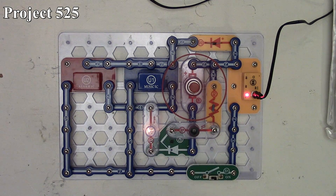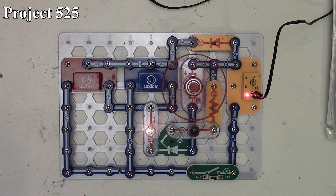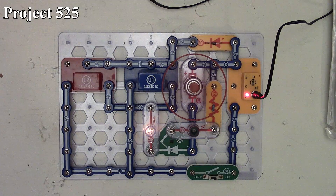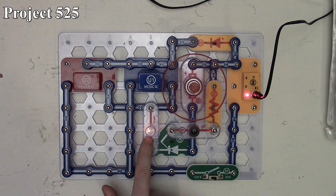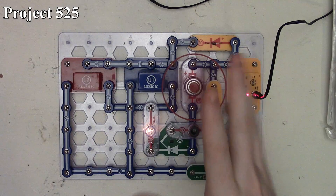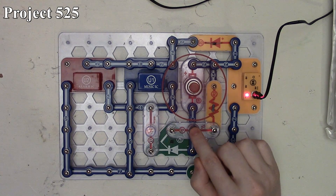Right now we're getting enough light into the photoresistor that our SCR can turn on and stay on. Our music IC and alarm ICs are putting out output and we can see it flickering through our L2 six volt lamp. We can also hear it and notice it through the fan — the motor is going up and down as those two outputs change.